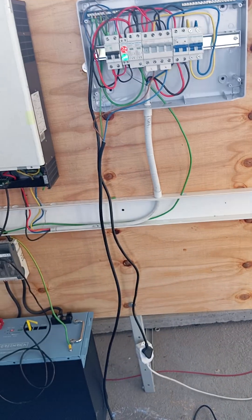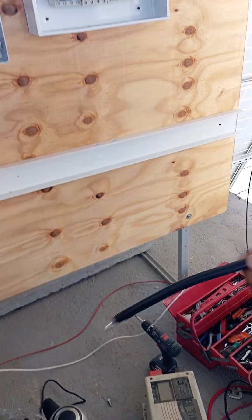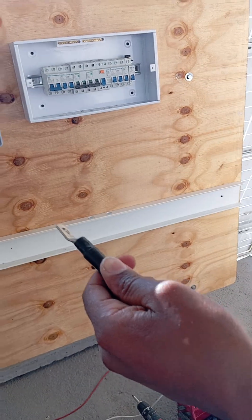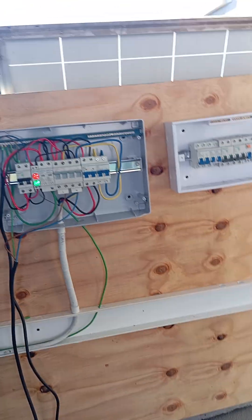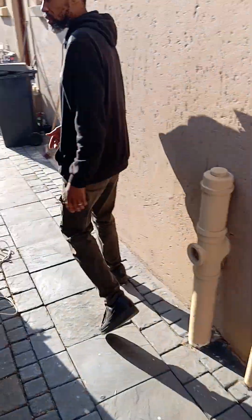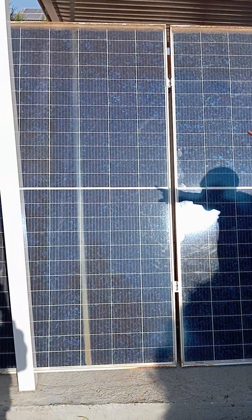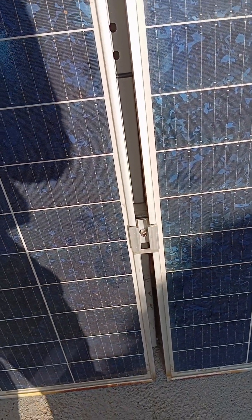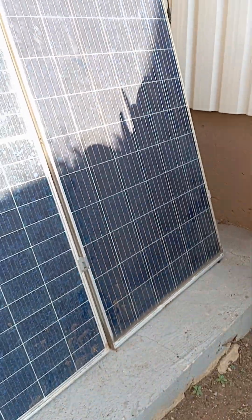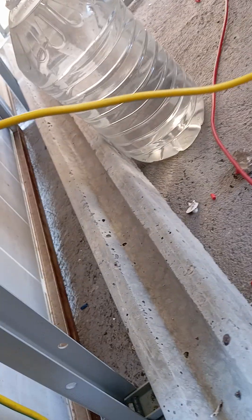We also covered cable selection, and we did how to crimp your battery cable. We talked about the panels — we mounted our panels, and above that, we put in earth plates on the panels for bonding purposes. And lastly, we did some explaining on how to earth your panels. That's the panel earthing point, that's the railing, and that's our six millimeter cable going in.